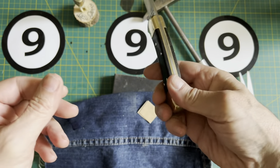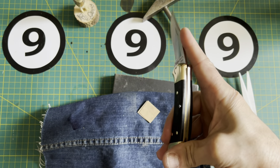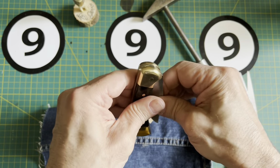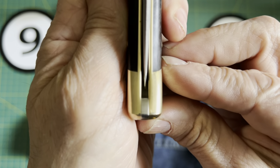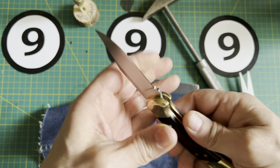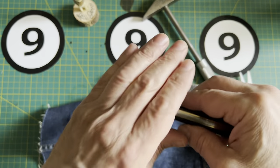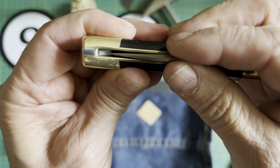Well, that's something new. We still have the kind of one-handed operation, but it's tightened up just a little bit, which is good — this is what I was looking for. Let me just open it like normal. I don't like letting it slam shut, but I've already adjusted for blade slam anyway. Where does it end up? Check it out — I actually centered it. Did we get any blade slam? One way to check is just to run the fingernail. And no, we have no blade slam at all. We just centered a Buck 112, and there is no movement anymore.